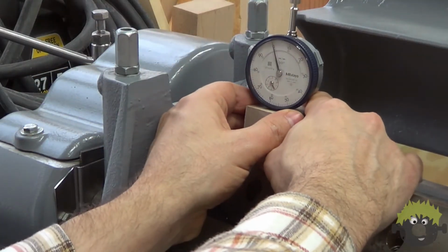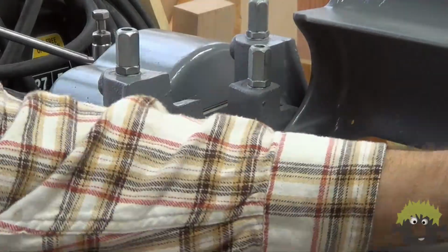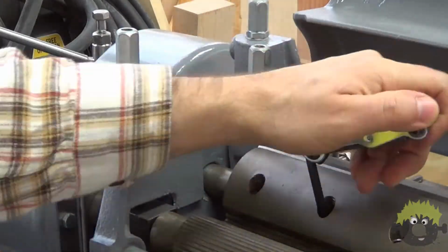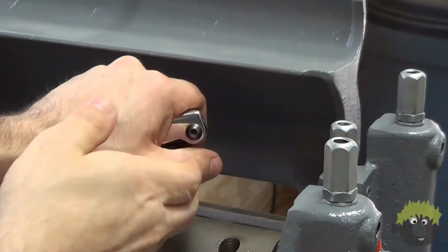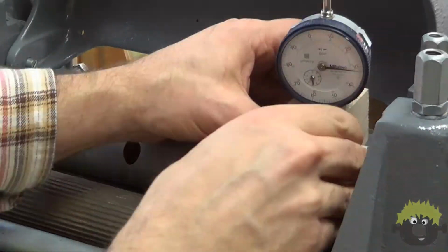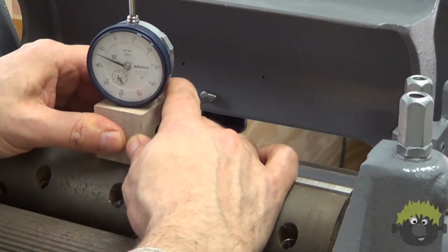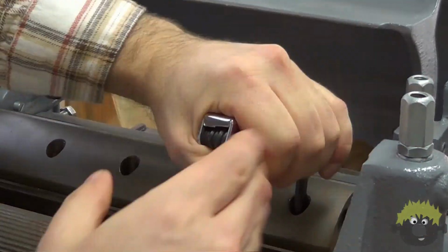Once all the knives were set exactly where I thought they needed to be, I really tightened down all of the gib screws hard. You certainly don't want a knife coming loose while the cutter head is spinning. So after torquing down all of the screws, I went back and did just one more sanity check on all the knives, and fortunately found that they had not moved.